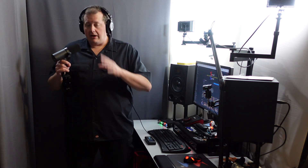For our testing here, I'm going to be using the Shure SM7B, which requires 59 decibels of gain if you want to stay a little bit farther away from it and hit good levels on something like a Sound Devices MixPre-6, which is where it's being recorded now. Keep in mind there is 59 decibels of gain right here, so if I were to unplug this — or even if I left it plugged in — it's adding a lot of gain, so if there's anything there you should be able to hear it.